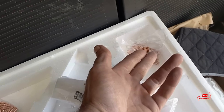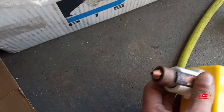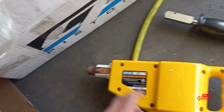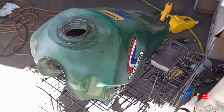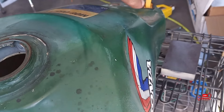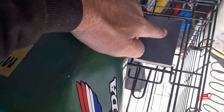This at Harbor Freight was 99 bucks, even without the discount club and all that stuff. What comes in there is obviously the gun, which comes with a slide hammer, and it comes with two different tips. This tip is for the thicker studs — thicker in diameter — and then the thinner ones here. Obviously you use whatever tip goes with the stud you're using. You put the tip in the tip of the gun, put a stud in there, plug it in, and then you push this down. I'll show you guys when we get to the tank — you squeeze this button and it zaps it to the tank.